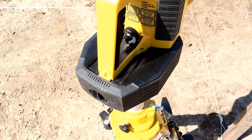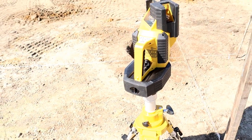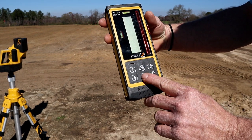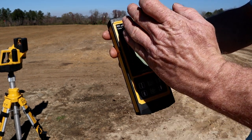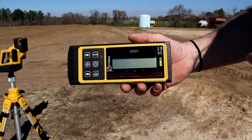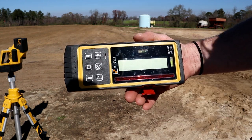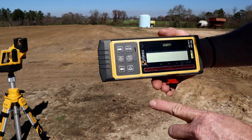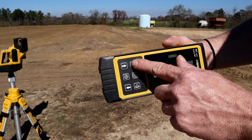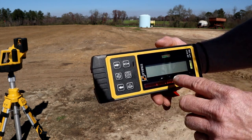This has a 5-degree range of finding my squareness. So I've got the Stabila. This is the power on, and then I'll mash this button, and the laser will find my squareness. I'll actually hold it in this formation, and I'll bring it till it goes to zero. Hold it right on that line. And these are to manually adjust it that I never use, and then this is self-explanatory, so you can get the laser beam tighter, and I want it as tight as that can be.